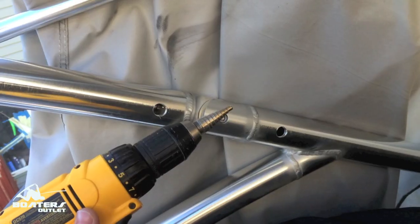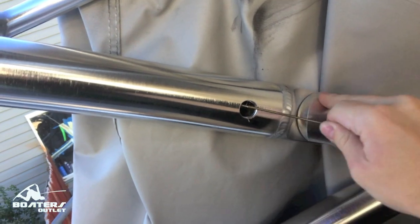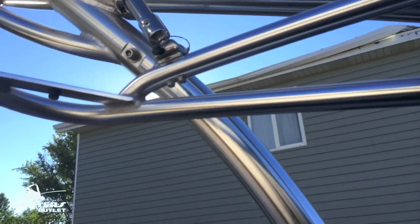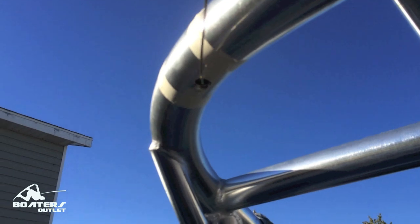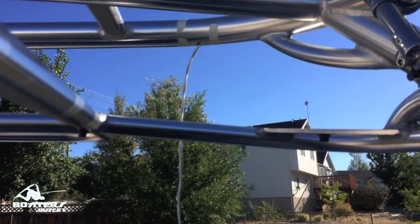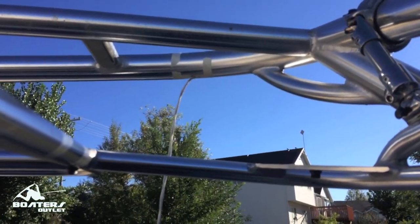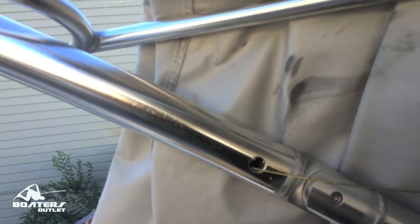You can see here I drilled the joint holes. I actually used a hanger — I took three hangers and combined them together and fished them through, which seemed to work the best for me. You can see here how I did that, and then I attached the speaker wire to the hanger. It pulled through real easy, and you can see here as it comes out how I attached it — just kind of crimped it onto the hanger.